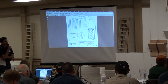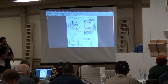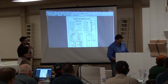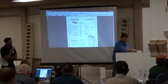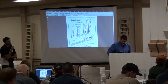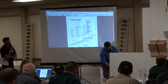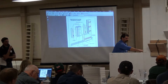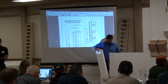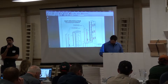Then you set up your panels so they're just taller than where the bottom of your opening would land. Build all the way through — a lot of times you'll have some marks down on the footing or in the c-channel for where your opening is, so just make sure to build just past it.